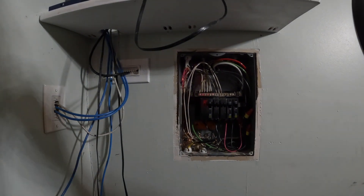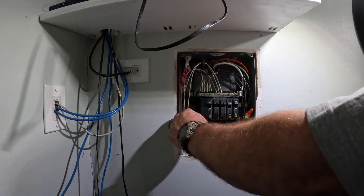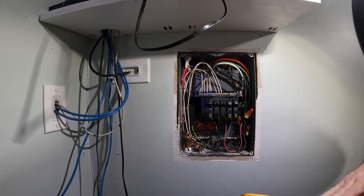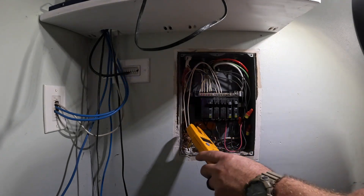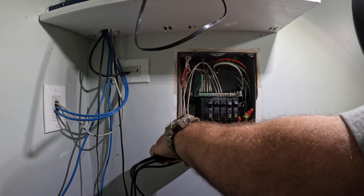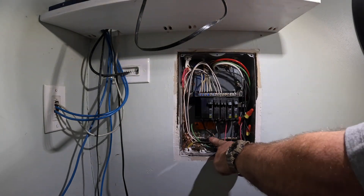It's December 2nd and it would figure it would be cold today, but it's not. When you start up these electric heaters, you want to burn off all the packaging oil that comes with it — that's why I'm running it today, just to get that smell out so my wife doesn't have to deal with it when she turns it on. I've got it cranked at the full thousand watts right now — it's at 4.1 amps on this side and 4.0 on the other side. So it's a total of about 8 amps.